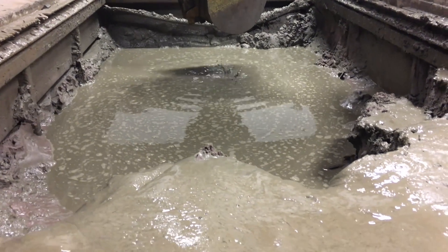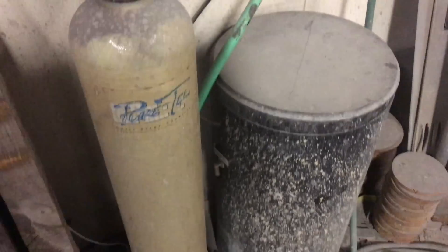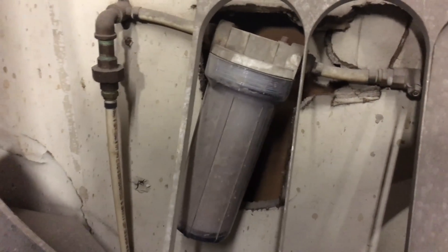This is why our water is so dirty, but it's not dirty when it comes out of the jet. The water that comes out is actually very filtered. First, the water goes through this water softener right here, and then it comes over to this filter, which is about a 6 micron filter. Then it goes into a 1 micron filter, and then into a 0.5 micron filter. This is the pump right here — that pressurizes it up to 60,000 PSI. Then it comes out of this tiny hose right there, and it only uses about a gallon, a little under a gallon and a half a minute. So, not a lot of water.